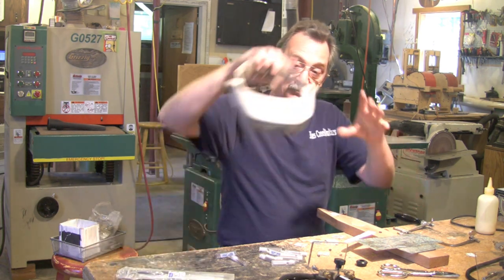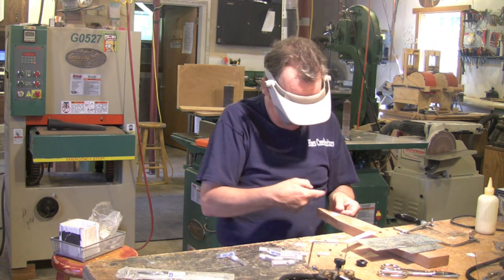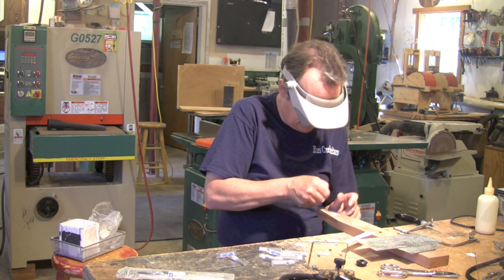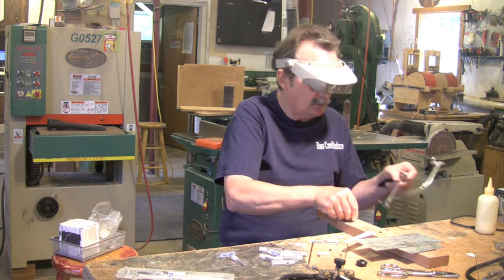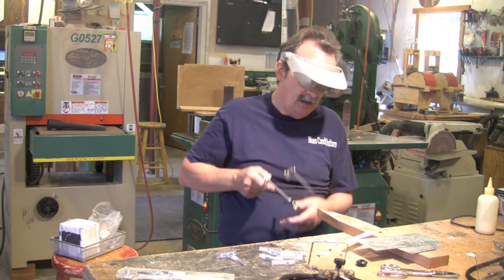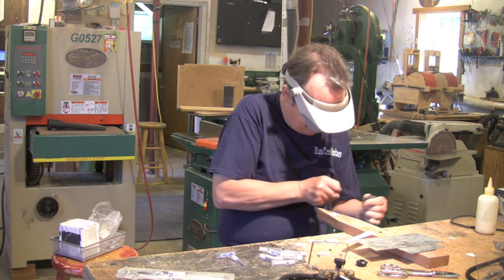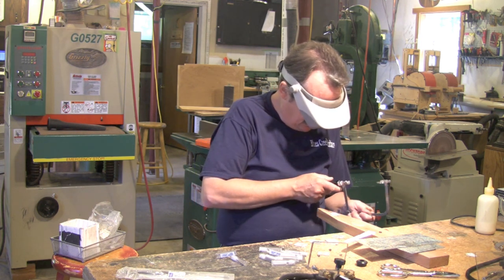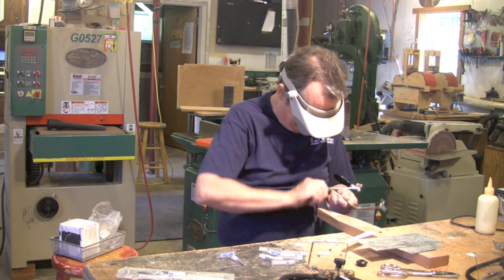I need to put my little eyeglass on because I want to take a look at my blades. The way I'm laying that, my blade is showing that it's sharp this way. You can tell by putting it on your thumbnail — you can feel it grab. Since I want to cut on the down stroke, I'm going to adjust this. These go in and out. I'll put the blade in on the top with the teeth out. Because I want to apply tension to this blade, I can see I have maybe a quarter inch, and I tighten that up.